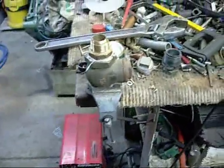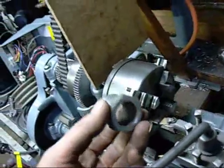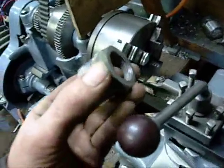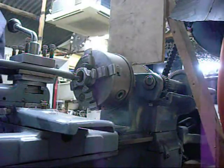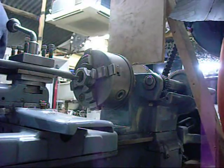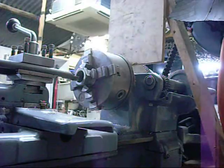I'll find another fitting for the other end. Since I don't have the appropriate brass bushing to solder the pipe into for the outlet of the check valve, I'm going to take one of these reducer bushings - which I have plenty of - and bore the threads out until I can fit the pipe into it, on the lathe. These cheapo Taiwanese fittings never really run true, but it doesn't really matter because I'm going to machine it oversized so I can move the pipe around and square it up while I'm soldering it.